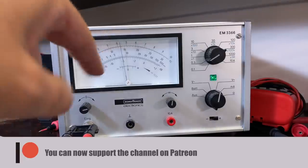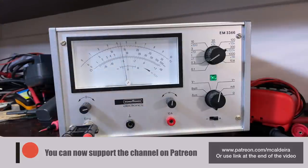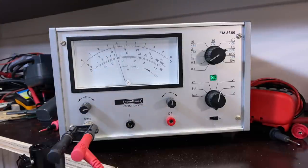So here we are, we've got a reading. This is on 0.3 volts AC. I can adjust it by increasing or decreasing the volume. I'm going to leave it at about the center, and I'm going to start on that core. Now, just to show you that we are getting a tone, I'm going to touch that floating wire from the secondary, which is connected to the AC voltmeter, to the speaker. See that? We can hear it, but we don't want to.